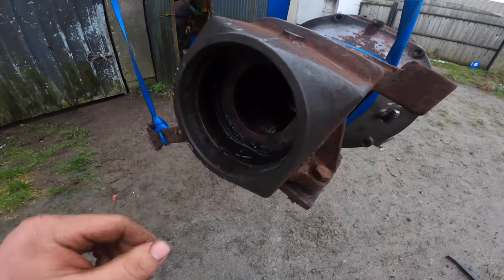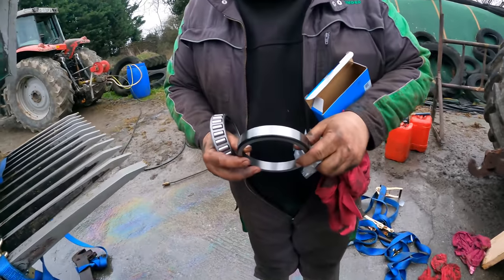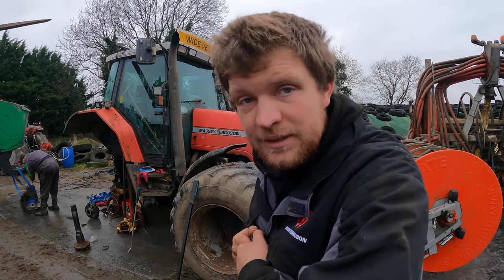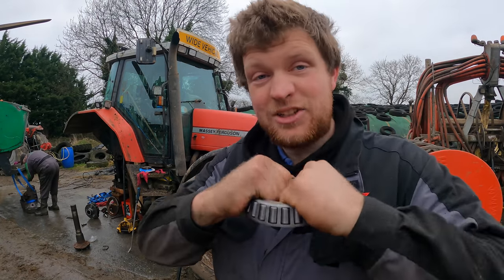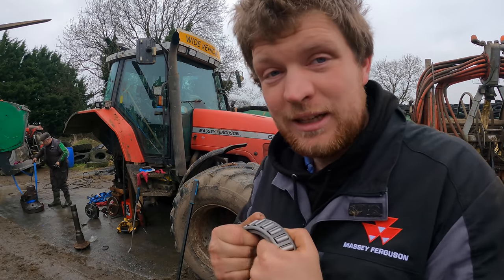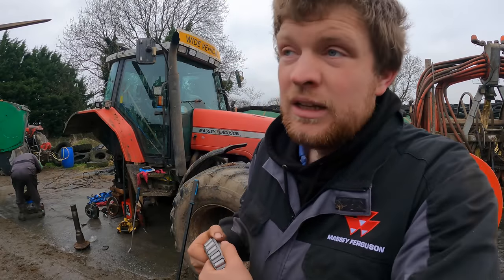At long last. We'll have some washing to do now because there are chips from the welding — need to get that all out and check the new bearing shell is the same as the old one, which it is. I'm heating the new shell now — it just has to expand a little bit and it slides in over. Last time we did these at the house, we put the two wheel bearings in the oven and heated them and they just dropped down over the half shaft no bother. Father Phil is just fitting the new shell.